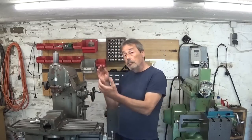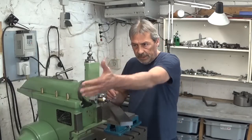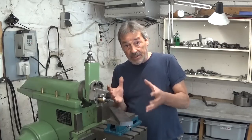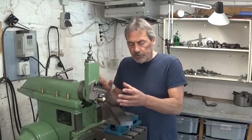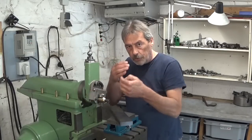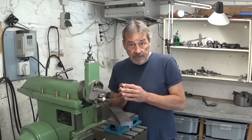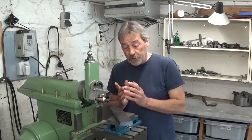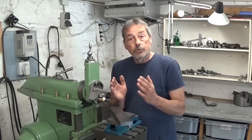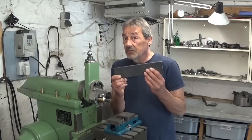And of course, milling machine or shaper. I think if you compare the shaper and milling machine I have here, they're about the same size, same capacity. You cannot take enormous cuts with the shaper, and you cannot take enormous cuts with the milling machine. So they can be compared, I think. Now, the shaper in this case is not really an option, because the maximum useful stroke length of it is 200 millimeter. In my part, 260 millimeter.